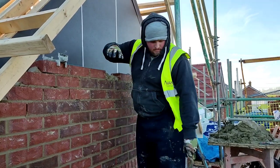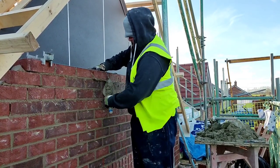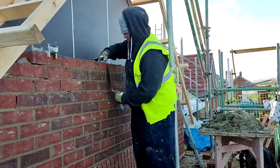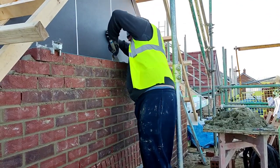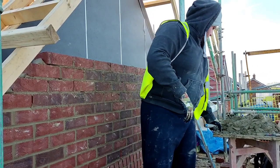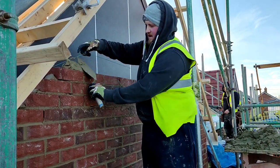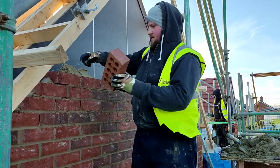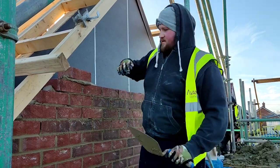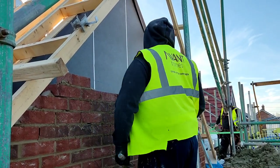Still using the nine-inch trowel as you can see — still using the W. Rose. It's going strong. I don't think I'd use another trowel now. In this clip you can't tell, but the mortar was like chewing gum today. We're on different silos so it's a lot better, but if your silo isn't mixing it right — which can be the case sometimes — it makes your job ten times harder. I don't want to go to any bigger trowel, but I might try a wide version or one of those tile-setting trowels or a swan neck.